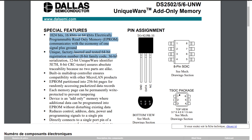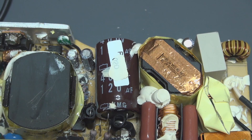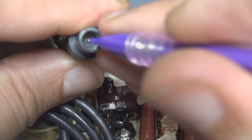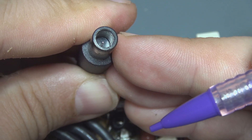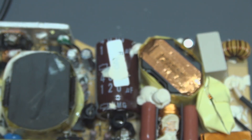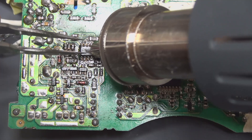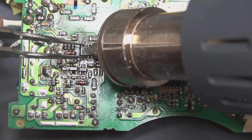What I thought was a programmable Zener diode is actually a new EEPROM — a programmable EPROM. Dell currently uses this kind of component to communicate with the computer. If the computer doesn't recognize the charger, it won't connect to it. You can see a very thin pin on the plug — this is the pin used by this EEPROM to communicate with the laptop. If it's not the correct charger, the laptop will never connect to this power supply. So I'm going to dismount this IC because I think it's faulty and try to find another one to swap it.